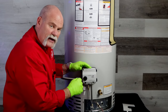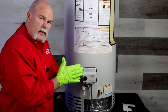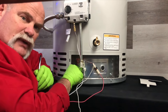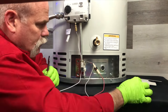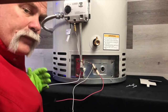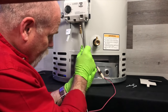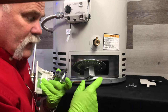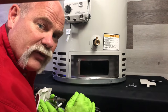It's up inside here where it makes its connection and it's bolted in the bottom. Now we're going to remove the screws that actually secure the burner assembly from the tank itself. I like to loosen the screws and then reach in and undo them by hand so I don't lose them. Now that all this is loose, you can pull down and get it out of the gas control valve and then slide it toward you. The reason you want to slide it straight toward you is it's got a lip right down here that catches in a slot on the inside. When you're going to put it back in, you go right back to that same spot.